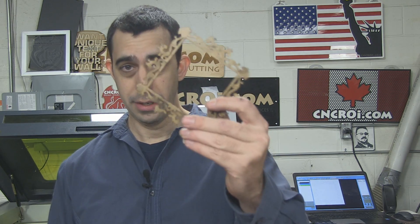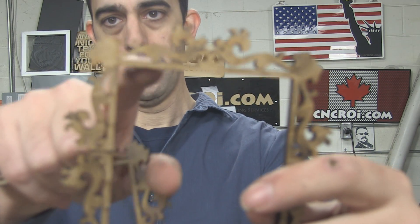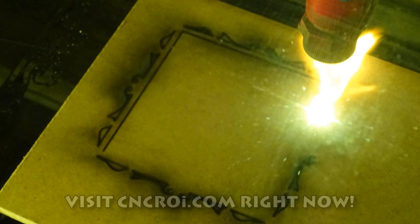That's reflected in the price you end up paying per unit, so knowing your price per unit helps me decide what thickness to use and what we can offer you. Let's say you really want a thick material but at the price point of a three millimeter material — one of the things we can do is scale it down so it's smaller, or get rid of some of these internal details. There's always some room to play around with, and if you're really set on a certain material, to a certain extent we can optimize the design to roughly hit the price point you're going for.